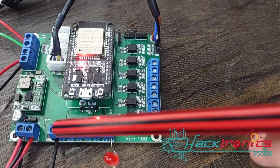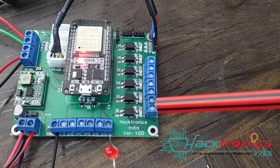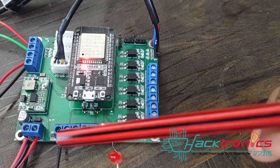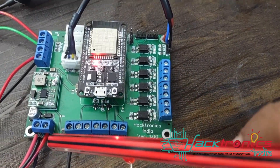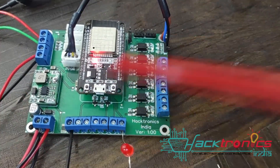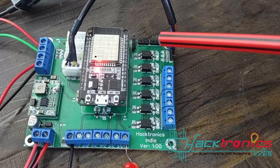The output will create the same voltage trigger that the machine requires. On the panel of the tea coffee machine, the buttons operate at 12V or similar, so this will also generate 12V. If the machine buttons use 5V, this will create a 5V positive trigger. Currently machine voltage and machine ground are connected here, but you can remove the jumper and use a different voltage level.